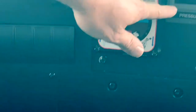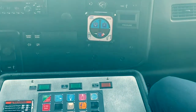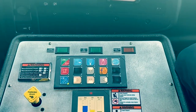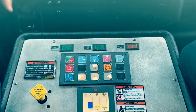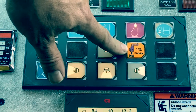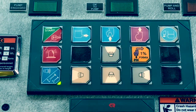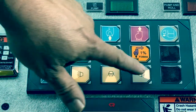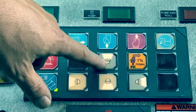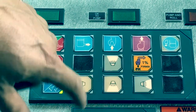The same pressure gauge can be found up here showing your real-time high pressure. An average pressure for us is going to be somewhere in the 200 to 300 PSI range — engineers, you'll note that's a little higher than our standard because it's for wildland firefighting. The foam button is here: if you want foam, that's what you hit. Just know that when you do, it's going to inject foam into the system and it will have to be cleaned out after we're done. The other four buttons are your scene lights: front scene, right scene, rear scene, and left scene. They're just a momentary click and you'll get a readback that they're on.